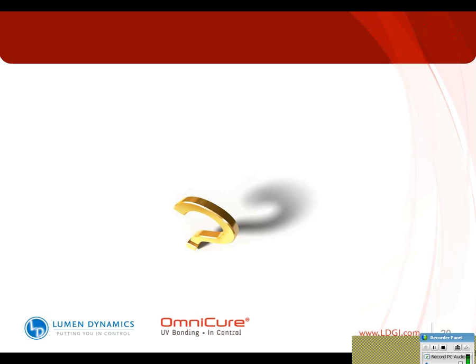Once every 8 hours, you want to be taking some sort of measurement from the system to make sure it has the right intensity. And if it doesn't have the right intensity, you want to be able to make adjustments. So one thing that's important, if you're selecting a curing system, is you want to make sure that you have the ability to adjust that output. If you don't have closed loop feedback, at minimum, you want to have the ability to have some control over the amount of light that comes out of that system. It's extremely important because then, for that process consistency, even if you're doing that manually, you have the ability to do that. But obviously, closed loop feedback is the technology that enables you to do that in a more automated way.